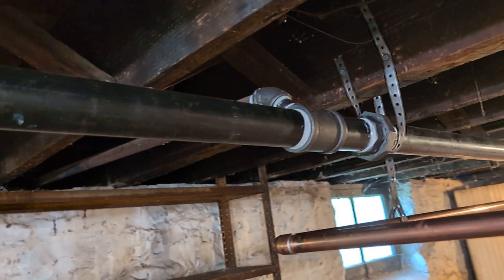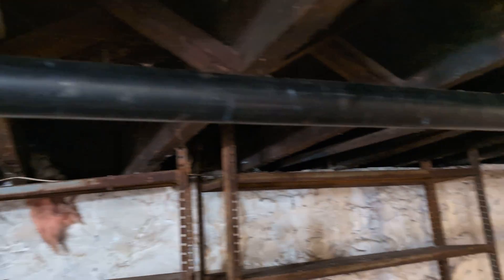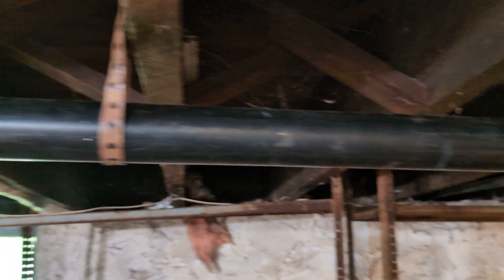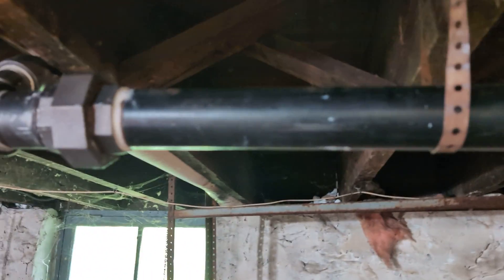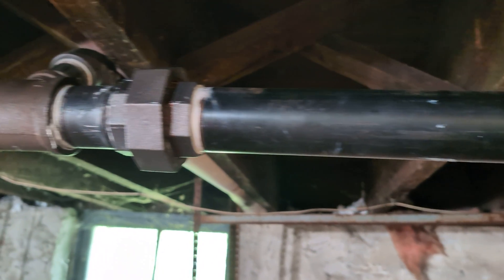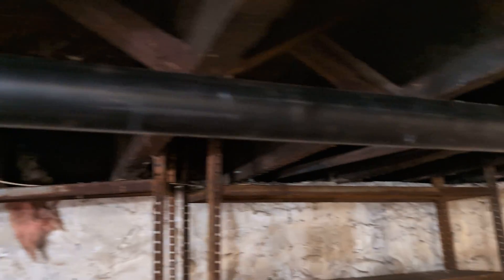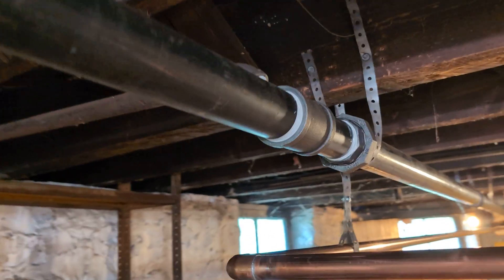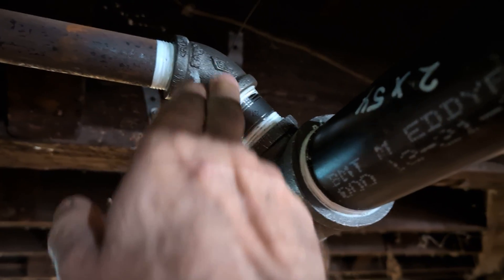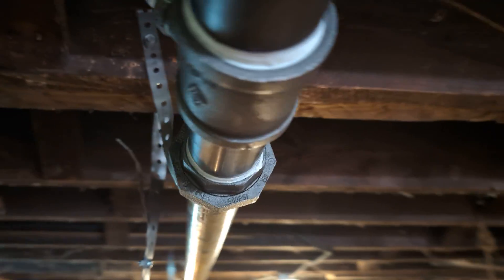We have this piece here, which is a 54-inch length — definitely a custom cut. We allow a nipple to be put in there to make up the length, so we don't have to do a whole lot of cutting and threading on site. Again, we cracked off the existing fitting and brought into a T here.